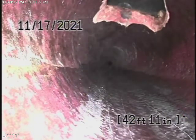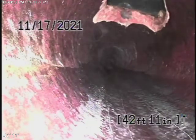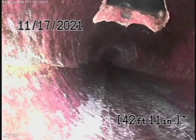Looking at the main sewer line, what we've got here right now is a clean out. Somebody put in a clean out that's kind of bootlegged. What they did is they dug down, made a hole in the pipe, and put this in — which is not really a legal clean out.